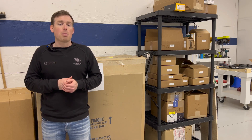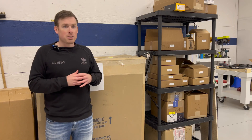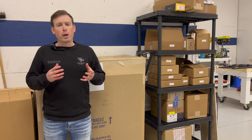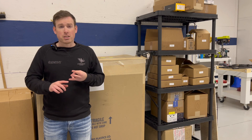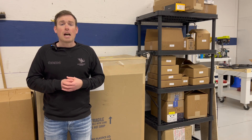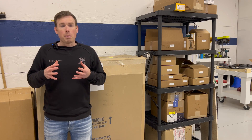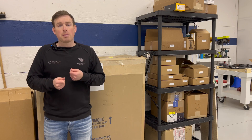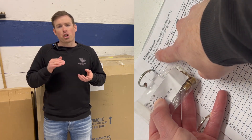Once inventory was completed, I put mostly everything on these shelves here and left some items in the large boxes, with the other larger parts scattered around the hangar. One mistake I made early on — but quickly realized — was that some part numbers are used in multiple places in the aircraft; bolts, nuts, and rivets are examples. For instance, you might find a bag of bolts and see in the inventory list that you should have 20, but you only have 10 in the bag. The inventory list is divided into multiple sections — fuselage, wings, landing gear, etc. — so you might be looking at the wrong page. You just need to double-check the label on the bag and the heading on the inventory list page to make sure you're in the right section.